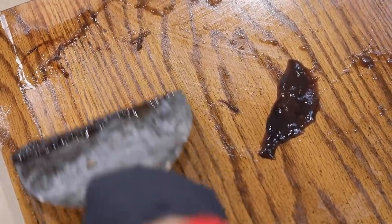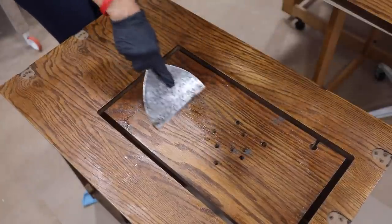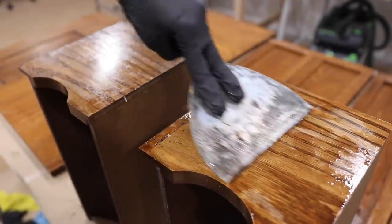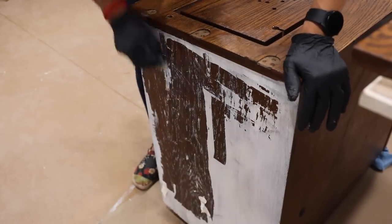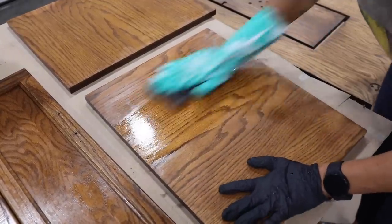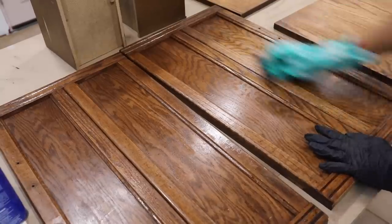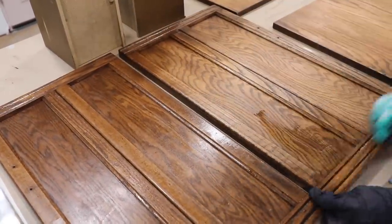All of that existing finish has to come off. The easiest way to do that is to use a paint scraper — be very careful, you don't want to gouge your wood — and have something to put this into like an old box or a milk carton, and be sure to discard of it according to your local laws and regulations. Once everything was stripped down, we had to clean up the wood. You can use some steel wool with maybe some mineral spirits. Just make sure that you clean everything up and let it dry out properly, including the rags you're using — those can be combustible. Make sure everything lies flat and allow it to dry before you throw those cloths in the trash.